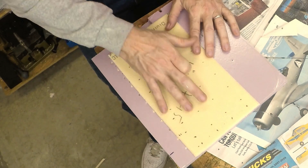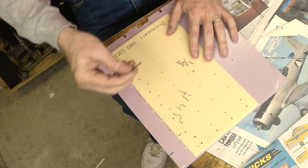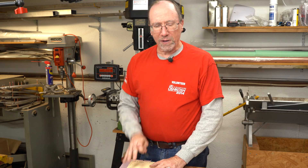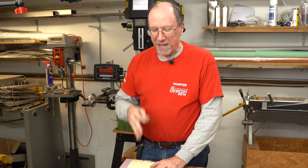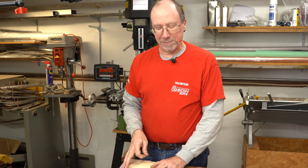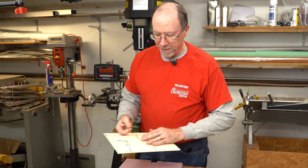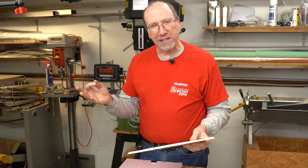If you happen to make a mistake in your hole pattern and get a hole that's off a little bit, don't worry — just go ahead and put one in the right spot; it won't hurt anything. Another advantage of going with the larger hole pattern is there are fewer holes, so it's much quicker to punch them. For a really large piece, say eight foot by four foot, I probably wouldn't punch these holes — I'd find a distributor that sells the core with the holes already in it. I'm not going to score the back side; so far I've found I don't need to, at least with the fabrics and vacuum pressure I'm using.